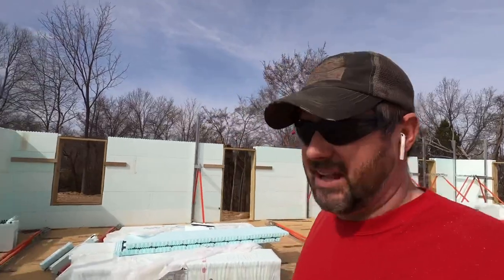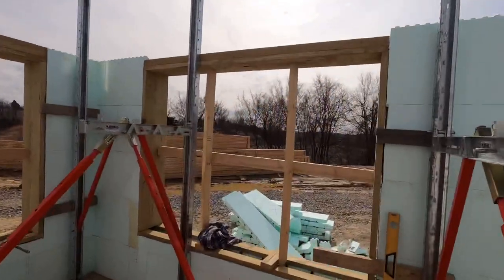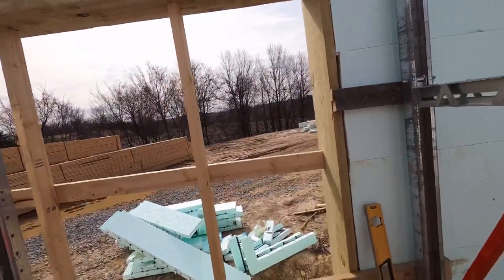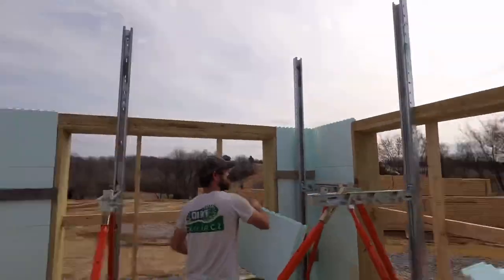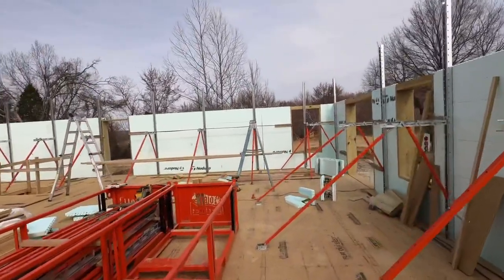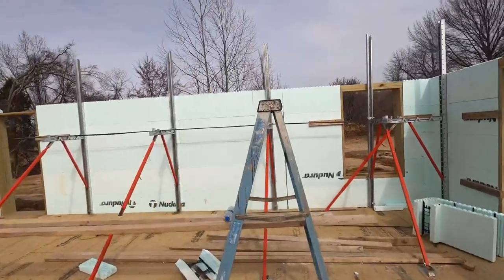There's a few things I want to point out. Now, if you guys follow me on my channel for a while, I've got a lot of the basics covered in other videos. I got an entire playlist on the channel about ICF and different jobs we did. But a few things, this is what we were talking about. Matt relocated the common right there where it goes through the window. That simplifies things, eliminates some scrapping, and a few other things. If you look over here on this side, we did not get the common relocated to the window. So not an issue. We'll get her strapped up, we'll get her poured. It's not gonna be a big deal.